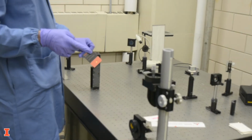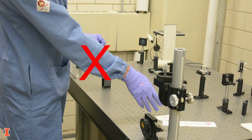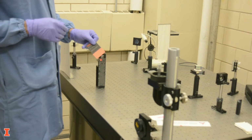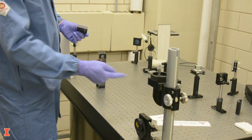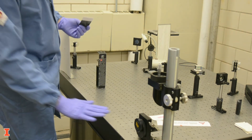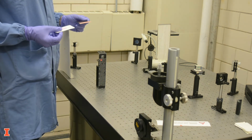Make sure to never put your arm into the beam path. With a class 4 laser, this could injure you and send the beam in an unexpected path. Make it a habit to always approach a component on the optical table from the outside. Never reach across an optical table.